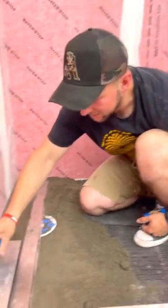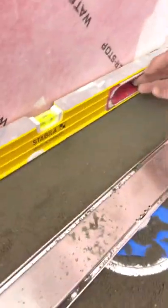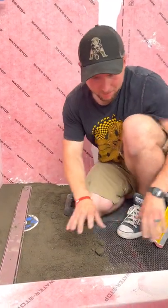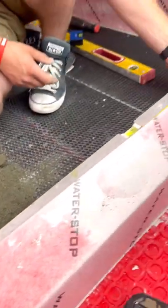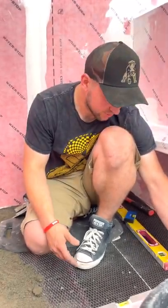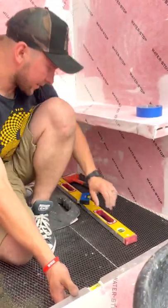You use a float, pick one side up a little bit and just drag it — that's how you get it nice and flat. You want it level across the drain, but pitched towards it. Then make a pile of mud up against the curb, rest your level there, and make sure you have a pitch of at least a quarter-inch per foot. We're using large format tile so we don't have to be that aggressive. I want the bubble at least in the middle of that line. Then just connect those two reference points and fill in the middle.